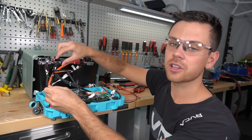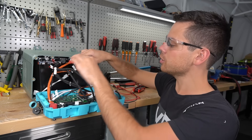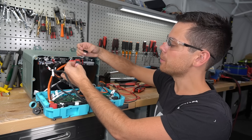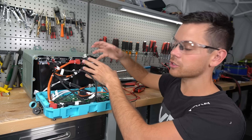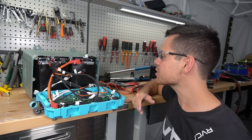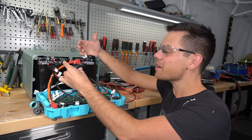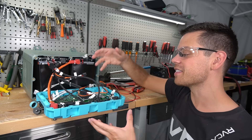I read the Chinese and matched them up, but found out that's not the way it's supposed to go — you want to mismatch them. Typically when you have two balance cables connected to a BMS they will be different sizes so you won't mix them up — like on the Overkill Solar BMS. But on this one they're the exact same plug. This is not a user-serviceable design for beginners. I actually think I switched the two cell packs, which is why the balance leads didn't match up.